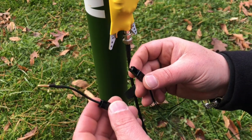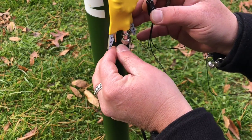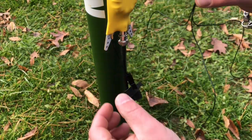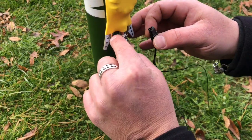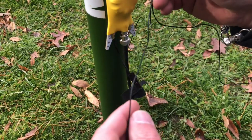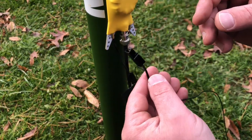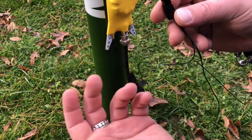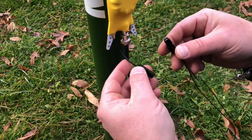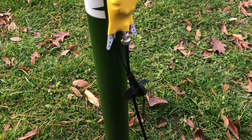Here's how I have the counterpoise wires going. I made a little pigtail to go inside the ground connections. There's a little socket there, and I use this — it's just more of that really thin wire that makes up this antenna. I use this counterpoise for a couple of other antennas, so I put Power Poles on it. They're going out in three different directions, and that makes it work.